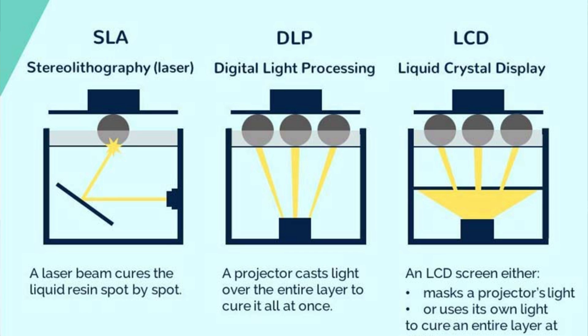The main difference between an SLA printer and a DLP printer is that SLA uses a UV laser beam, and DLP uses a UV light from a projector. There is another way of printing not yet available to most home printers — SLS, selective laser sintering — done through a powder by a laser. It's more difficult in a home setting, but I've noticed companies are starting to work on home SLS printers and we'll probably see them on the market sooner than expected.